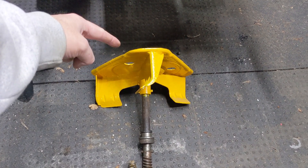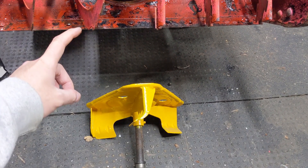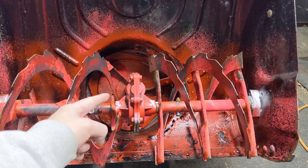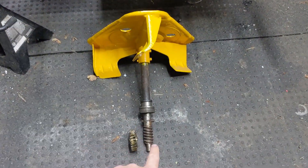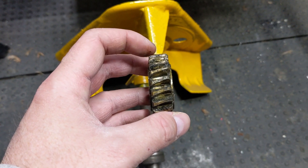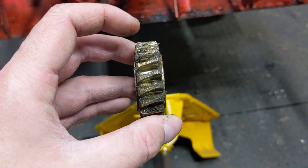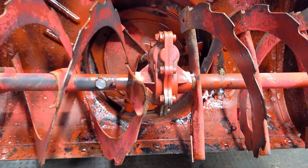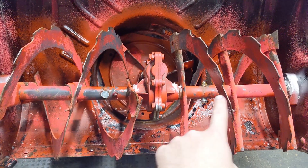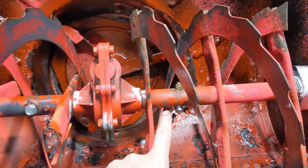There's going to be a pulley on the back of the second stage shaft. When you engage your auger handle, the idler pulley pushes in against the belt, putting tension on it and bringing the engine's rotation down to the second stage shaft. That starts spinning the small gear on the end of the shaft, which meshes up against the worm gear. The drive shaft and gearbox always want to remain spinning, and that rotation is transferred to the auger fins via the shear bolts.